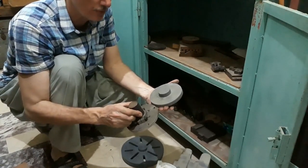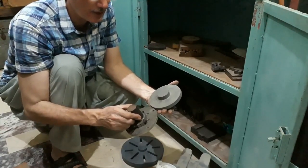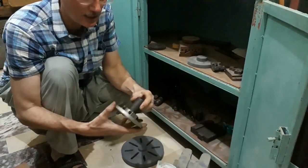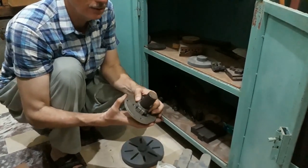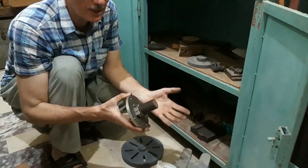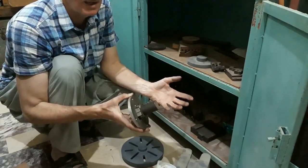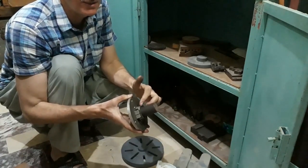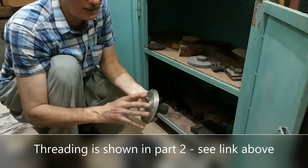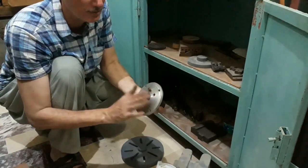I made this temporary backplate/faceplate out of aluminium, and the feature of it — which is a little bit unorthodox — is that it's merely clamped on the mandrel. At the early stages I just had the mandrel basically machined in somebody else's workshop. I later machined the thread and the register. So before I could do that, I had to have some way of holding the work, and the way I solved that was to make this aluminium casting and mount things off that.